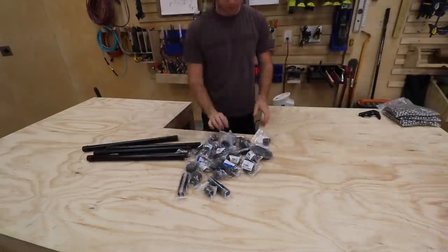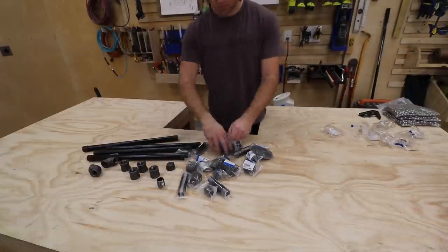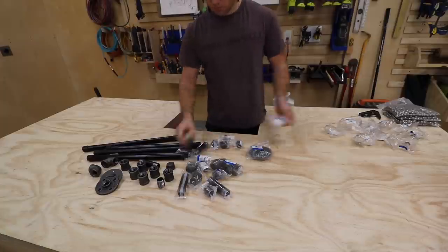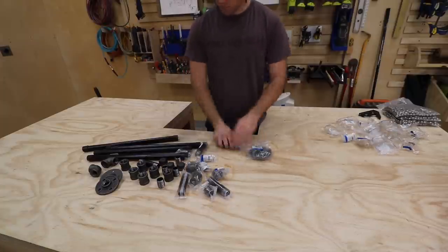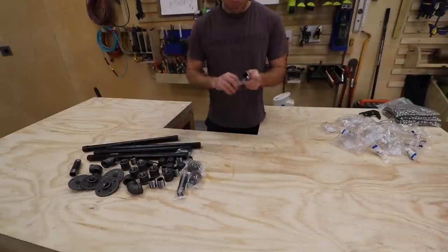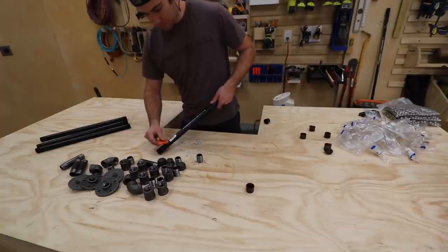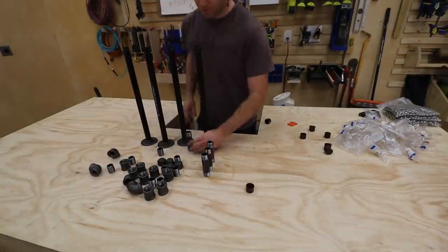I purchased all the metal needed. This is 3/4-inch black pipe. This ladder will have four rungs and attached to the wall at four points. Here's a list of the metal I purchased. Four 18-inch long pipes, four 90-degree elbows, four floor flanges, four caps, four 4-inch nipples.